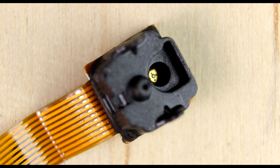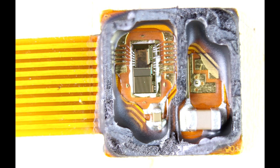The components are quite interesting. It's going to have two things in it: a laser which generates light illuminating a surface, and then a very specialized optical detector and some signal processing which is used to detect motion.